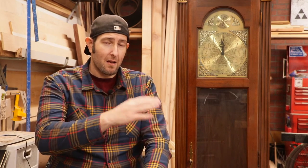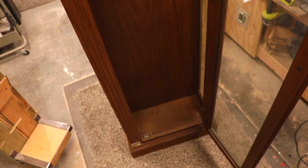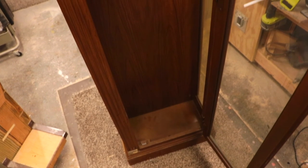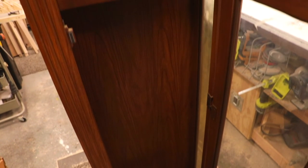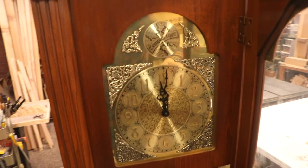I'm going to essentially just do a series of shelves on the inside. We're going to line it with some Spanish cedar, just do a skeleton frame with a series of shelf pinholes, and then do a little basin at the bottom where we're going to store the humidifier. And then each little shelf tray is going to house a hygrometer to gauge the temperature and the humidity. And then there's just going to be a couple other little custom details along the way.